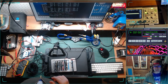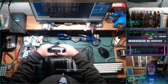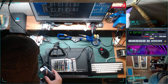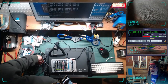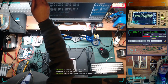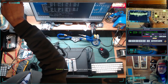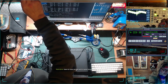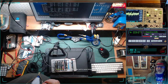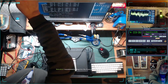All right, so I think it might be working. But I still want to hear it. Also, is my probe set at 10x or 1x? I think it is set at... What's set at 10? So I might not want that. I mean, that's some fun squiggles. Okay, yeah, because on the screen it's set at 1x, and the probe was 10x. So I changed that. I mean, that looks like the kind of jiggery pokery I was hoping to see. Set it to 10x if you want full bandwidth. Okay. Let's see.